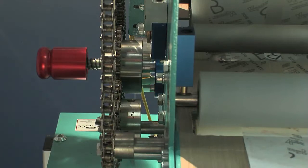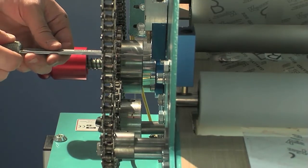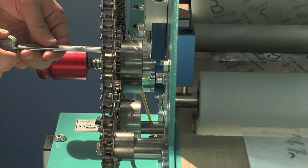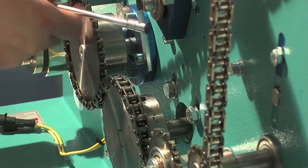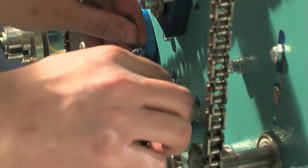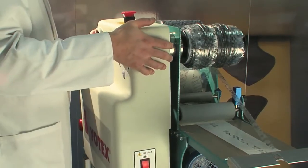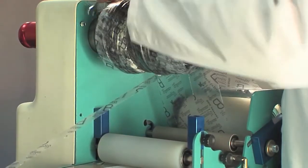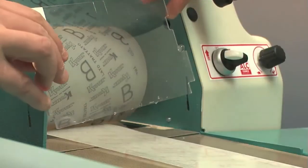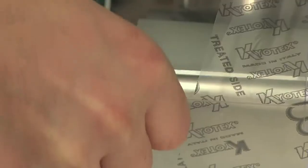Now align the gear of the gear motor to the rest of the transmission. With the help of a caliper, make sure that the distance from the wall is the same for all gear wheels. Tighten the grab screw which connects the gear to the shaft. Fasten the casing to the machine with the 5 screws you have previously removed. Mount the plexiglass guard and place the blade support shaft back to its working position by rotating it inside its seat.